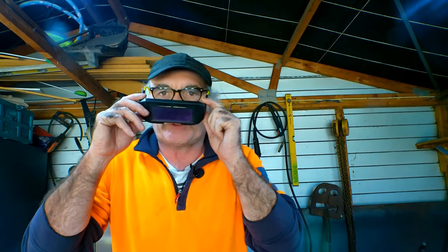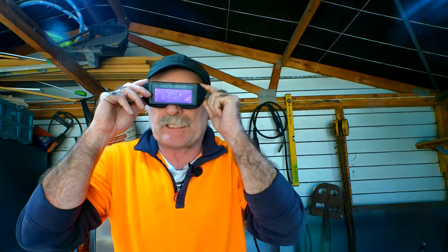If you're new to welding, never weld without a helmet on, and never weld with just goggles. I was a bugger for that — when I first started welding I was just using these goggles, and I was using them for the simple reason that they fit over my glasses.